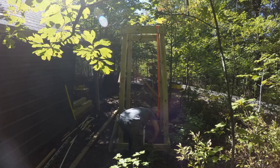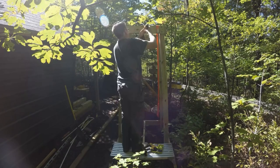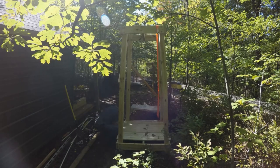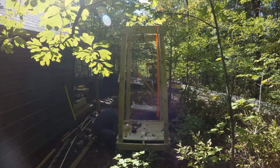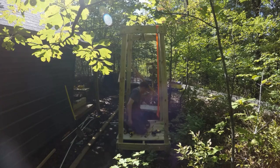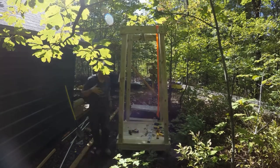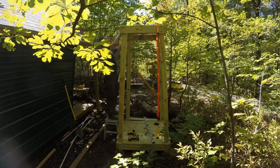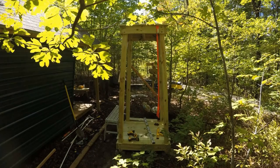A lot of the fasteners I'd temporarily used were decking screws, but I ended up taking those out and replacing them with lag bolts. Once I got the flooring in, it gave me a place to work — it feels better not working in the dirt. I really don't like dealing with the foundation stuff; I'd rather do the woodworking. Using the level as a straight edge, I could mark where all the screws had to go. It's a lot of work getting those put in, but it looks good when it's finished.